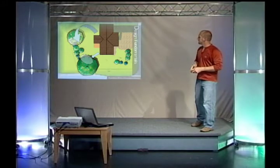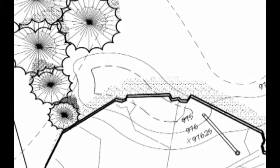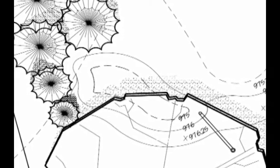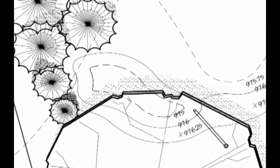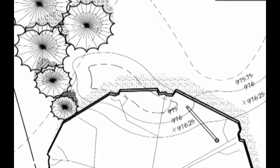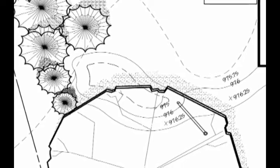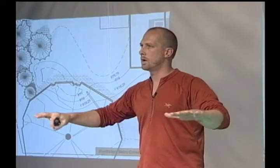In this setting, the ellipse represents where the rain garden location might be, because right now water sheet flows down to that location — so that's a good spot. Zooming in on that ellipse, this is a grading plan for that same rain garden. The dotted line on the bottom of the rain garden location cell is the basin. It's completely flat and level. If you take your carpenter's level and set it on the finished grade of the rain garden floor, it won't break the bubble. The idea is to spread the water out evenly.